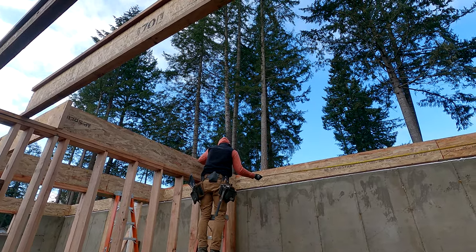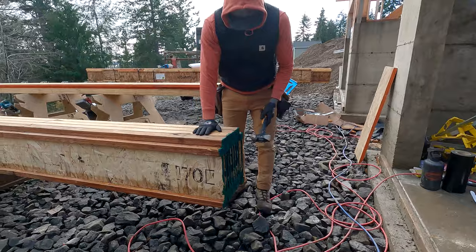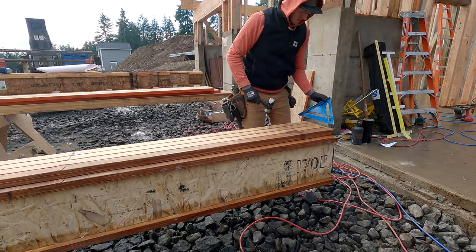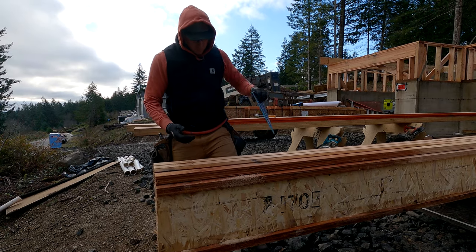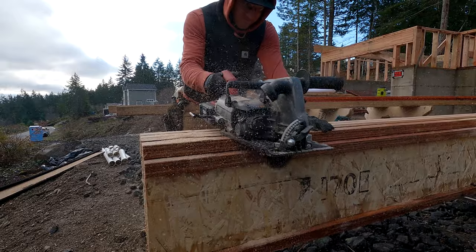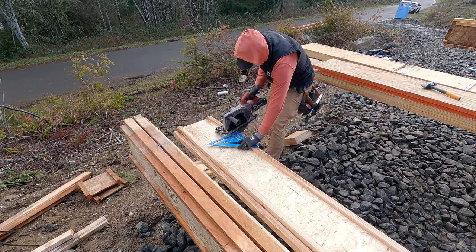I got 21 foot one eighth. Hey, if you guys are awesome framers, why aren't you using a laser to measure those I-joists? Because like all great hipsters, we are still analog — and also, it was in the truck; we forgot about it. Now, there's a variety of ways to cut I-joists. We try to leave them banded as much as possible. Kyle's just making sure that they're all reasonably close, then he's going to pull one measurement — we want to measure one of them whenever possible. My preference would be a chainsaw, but here's one way to use your beam saw: cut through the top flanges all at one time, effectively marking all of the I-joists. Measure once, cut once to mark the rest. Then he's able to cut two at a time without marking square — just use the square. Nice, simple way to do it if you don't have a chainsaw.